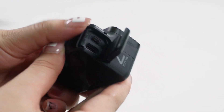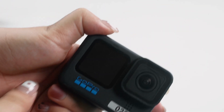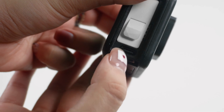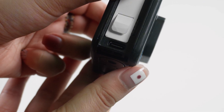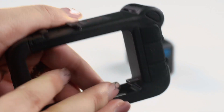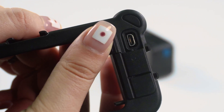Next, let's take a look at the two GoPro cameras. We're using two GoPros because the models before the Hero 8 and those after the Hero 8 have different built-in port configurations. The GoPro Hero 7, which is a model prior to the Hero 8, includes a built-in HDMI port for outputting camera signals. However, the GoPro Hero 11 doesn't have a built-in HDMI port. Instead, it has a USB-C port mainly for charging and data transfer, so we need to use an external HDMI port — specifically the MediaMod, which provides a micro HDMI port. With the MediaMod attached, we can transmit the GoPro's camera signal to the YOLO box.